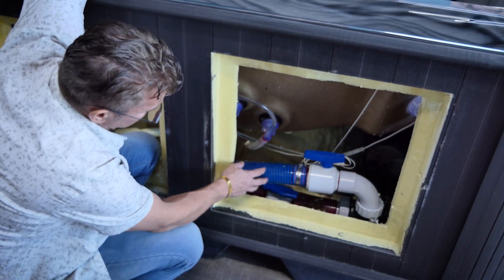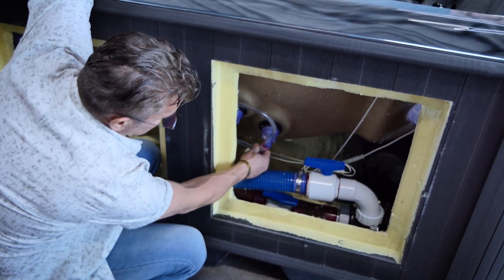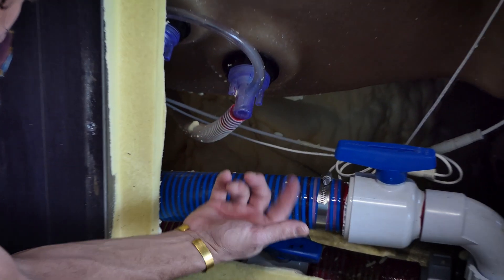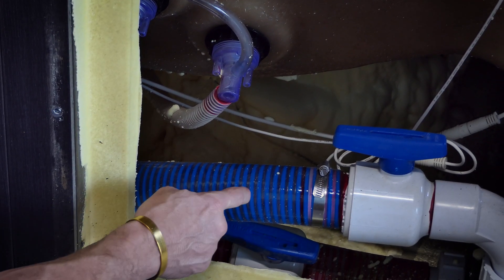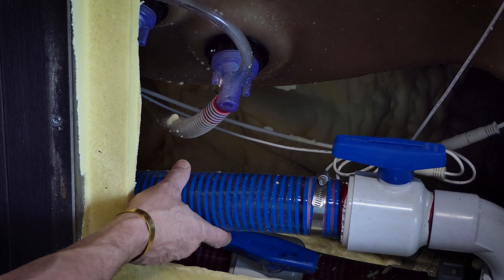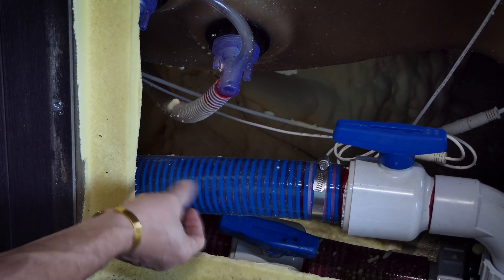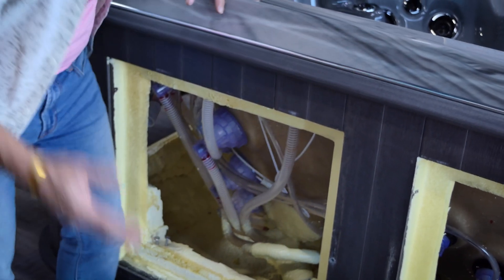The other thing that I think is important is that it's easily identified. If I do have a problem with this, sometimes you develop small little holes — we call them snake bites — that can happen over time. Some companies will tell you that the hose shakes around and that's going to cause it to leak. We actually tack the hose in with high-density foam so that the hoses don't move much — though they'll move a little, you just don't see it.